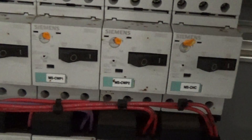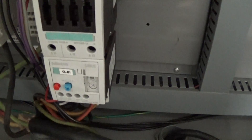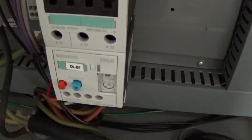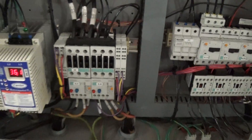Right now you have your contactors in here — for chilled water pump one, chilled water pump two, and fan one. Then your compressors: compressor A1 and A2 on circuit one, and compressor B1 for circuit two. So there are three compressors total. Circuit B1 is one bigger compressor, while circuit A consists of compressor A1 and A2, which are two smaller compressors.